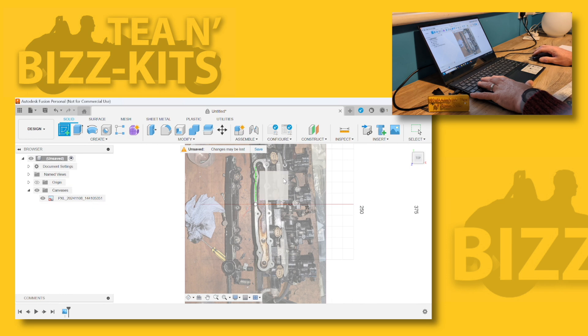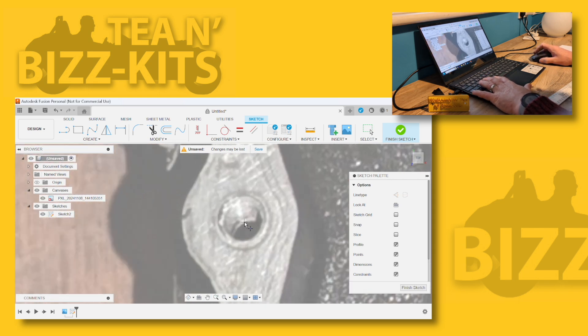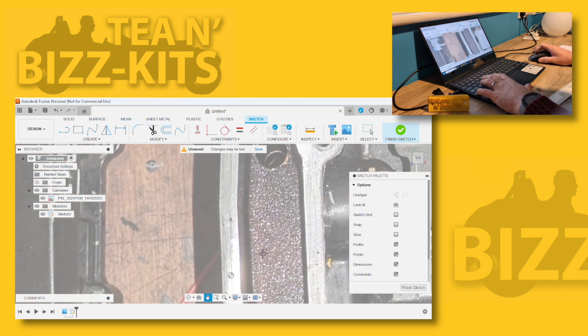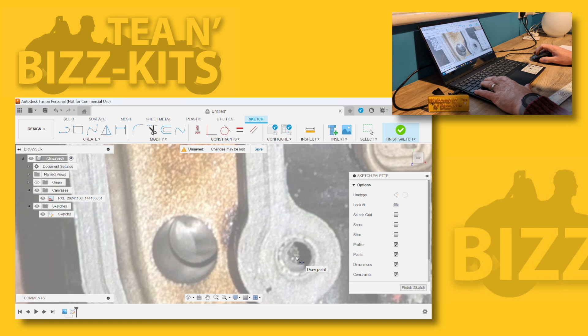I'm going to pick up that first point again and put points in the middle of these holes, because obviously this is an important feature to get right to make sure that my screws line up properly. I do this by picking up on the edge - we can see down inside this hole and you need to try and not allow that to disturb where you're going to put the centre of the hole. I'm trying to concentrate on the sharp metal edge of the hole. How I do it is I get it about this far zoomed in, kind of blur my eyes and then just hit point, and just see if I can get it about right. You're going to be out by point one or point two of a mil here and there - you're not going to get this exactly spot on, but we're going to give it a go.